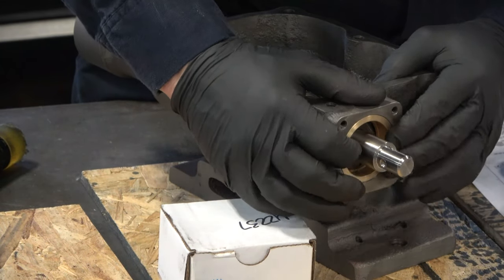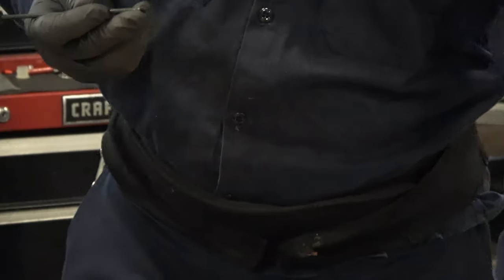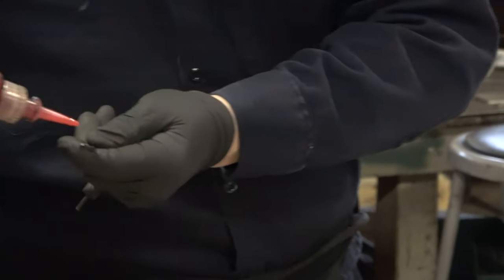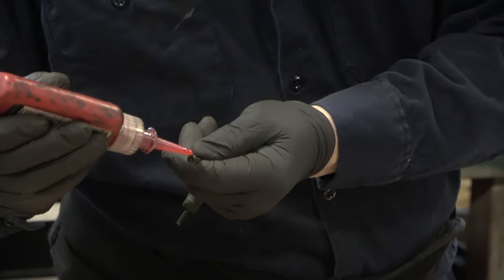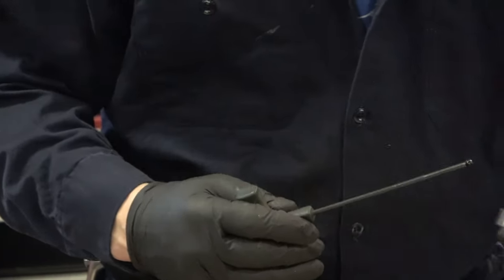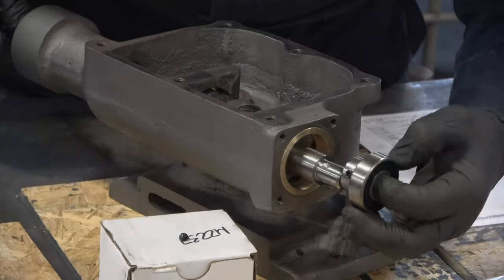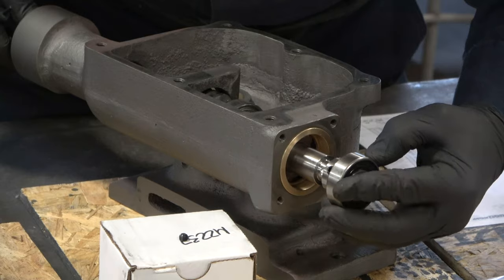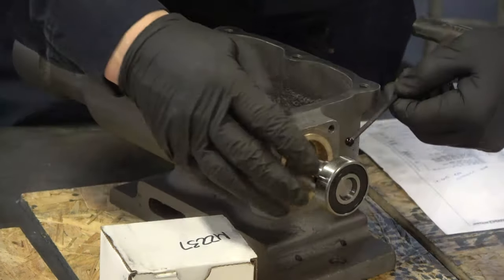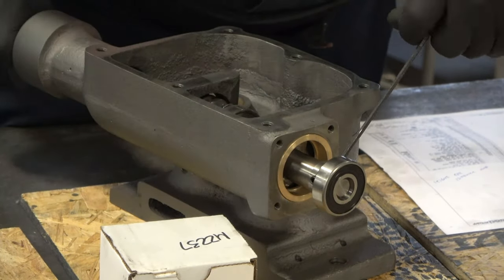The bearing will fit into that space. The bearing has two set screws 90 degrees apart. We remove these set screws using an Allen wrench and put high strength Loctite on the set screws before reinstalling them on the bearing sleeve. Once the set screws have been put into the bearing sleeve, the bearing can then be fit onto the shaft so the set screws line up with the dimples, and tighten down to prevent the bearing from moving during operation.